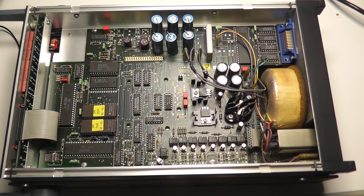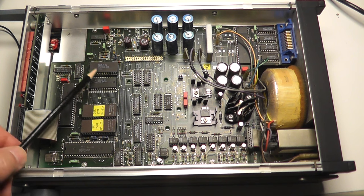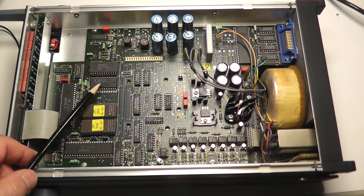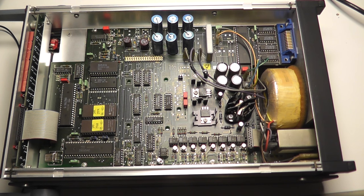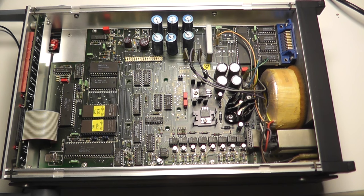So on the right side we have this interface to control the multimeter from another device, from a PC for example. Then in the middle this one is an EEPROM, DE52B13, which contains some data stored for the next session. So if you power on and off, you have some information stored. And now here we have the RAM, MB8417, and the problem is now how to get this RAM. I compare this RAM with a well-known RAM 6116, and it has the same pinning of the device, but I cannot get the 6116 in this package.